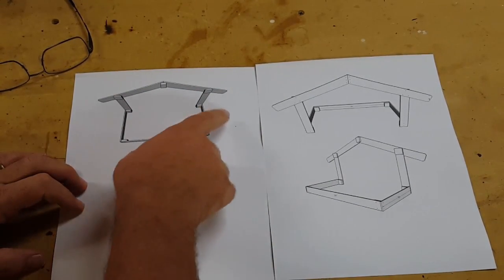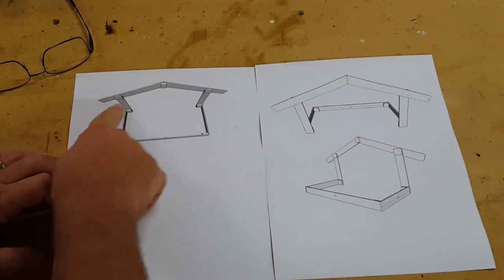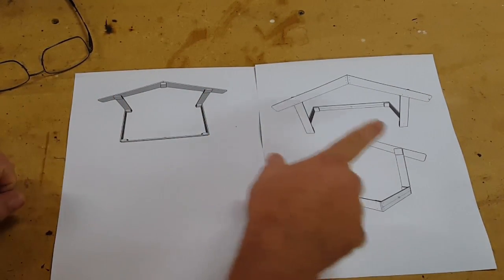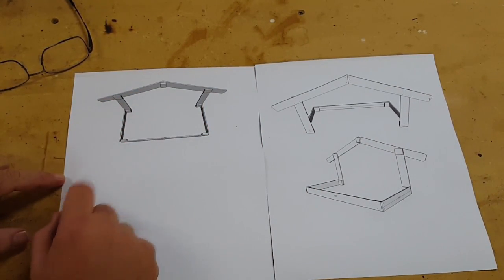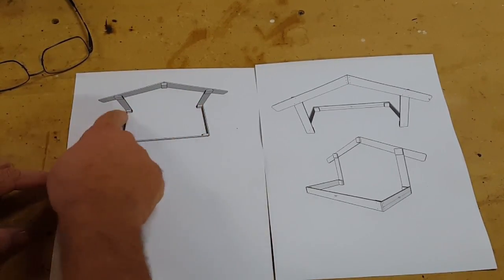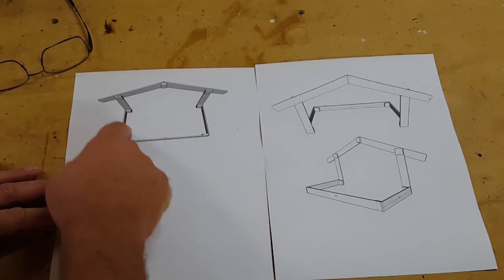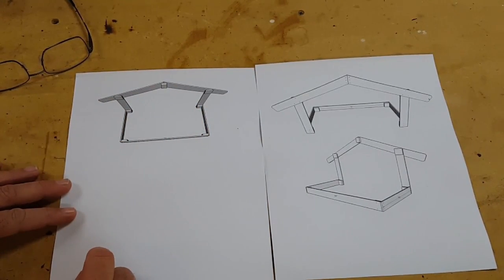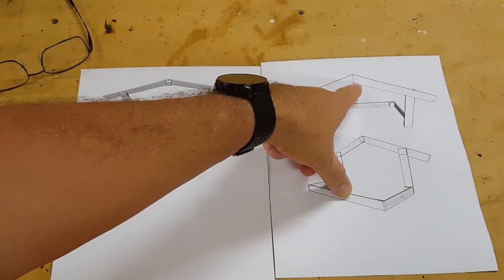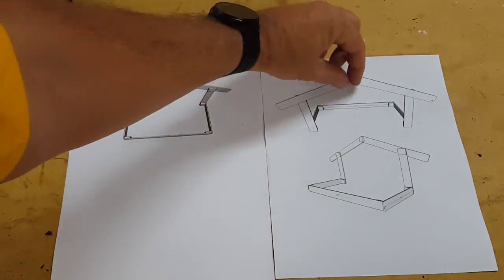Just five pickets. We're going to cut them to length, drill our holes, and cut a bunch of scrap. Actually, these two pieces here will be the cutoffs of some of the dog ears, so you can just use those. On the bottom, you're going to need to use a two-by-four to give you some material so you can come in from the side and the front. You're going to need five scrap pieces of two-by-four and two of the dog ear cutoffs. This one should be a 22.5-degree angle so that they'll butt together properly.